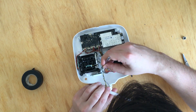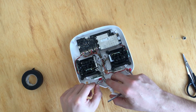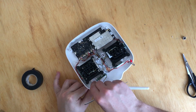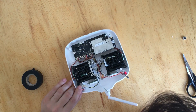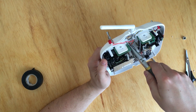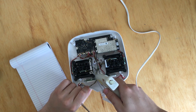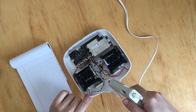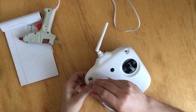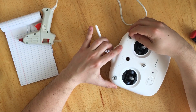I am fitting the cables into the groove and putting them under the antenna as before, making sure that the markings I made earlier match up so I know where each switch goes. I am repeating the same procedure on the left side of the controller to fit the S1 switch. Then I am hot gluing them in place so they will never interfere with the new support. Now putting the switches back — really simple, using a flat head screwdriver. Doing the same thing on the other side. Everything seems to be working perfectly.